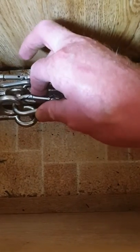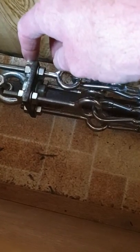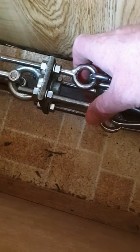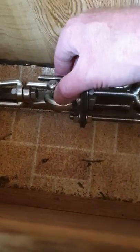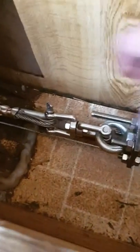I've swaged each of them so it's got a better grip, then I've put it onto these and then onto the eye bolts. I drilled out the plate and put bigger eye bolts into it because the ones that were on it were pretty poor quality. I also drilled it out here and put this bigger eye bolt on it with a swivel, so the swivel stops all the cables twisting up when you're cranking it — which seems to happen — and then they don't lift evenly. While we were at it, we swaged this one as well.